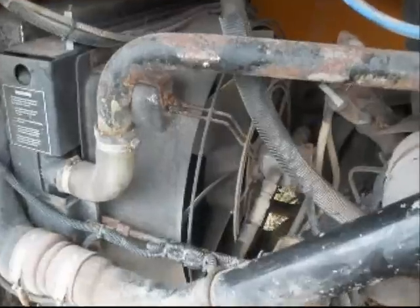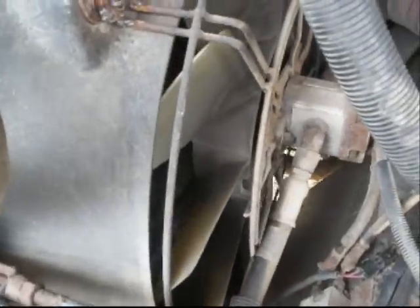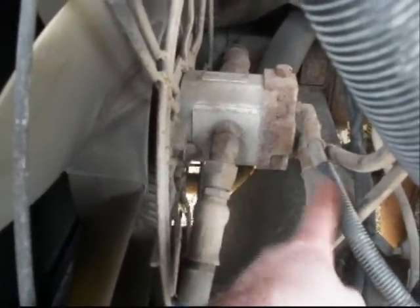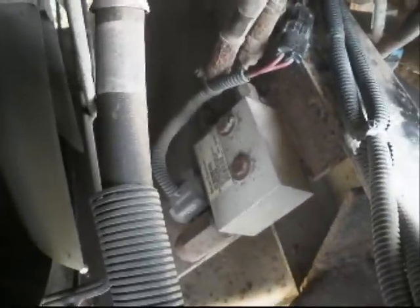But there's more to it. Fan speed varies — it varies with engine RPM and also by the amount of oil that bypasses the fan drive itself, which is controlled by this pilot circuit, which is these three hoses over here. This pilot hydraulic circuit consists of the charge air override solenoid and the thermovalve.